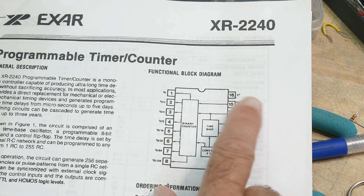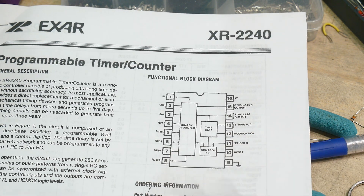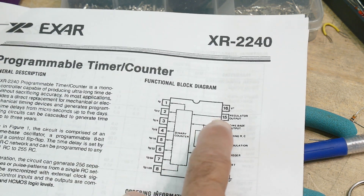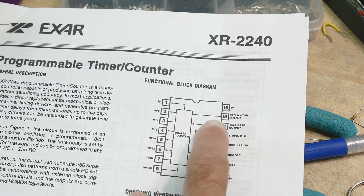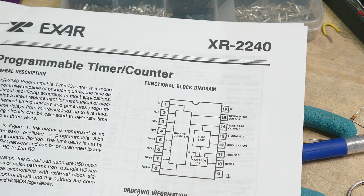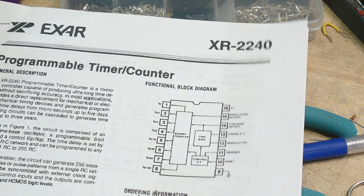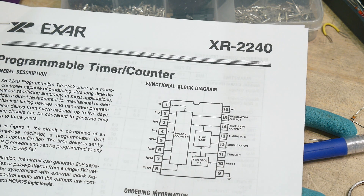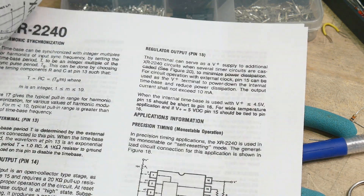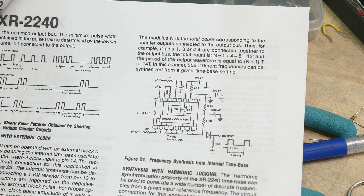There's a weird regulated output — I think there's a 5-volt? I don't remember. There's some type of internal voltage regulator that comes out pin 15, and you loop it around and bring it into pin 14. It's kind of a silly design, but I guess that made it more flexible or easier to test in production or something — I'm not sure about that. There's really not much to say about this thing, but the datasheet is really cool and has some neat ideas in the back.